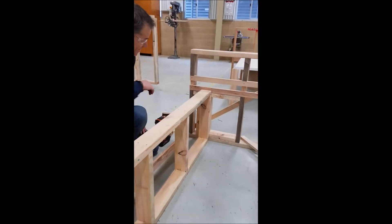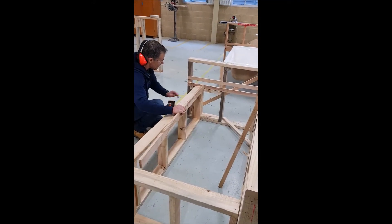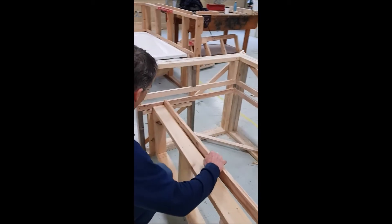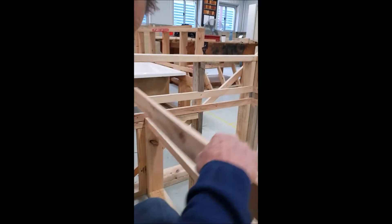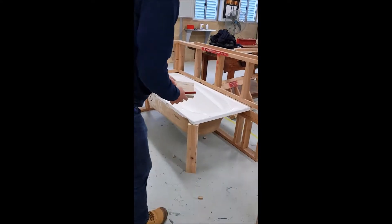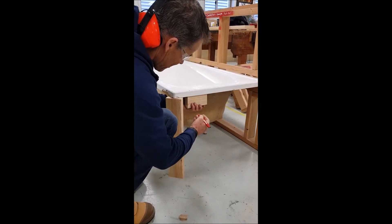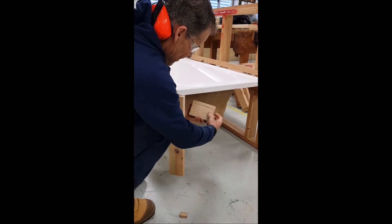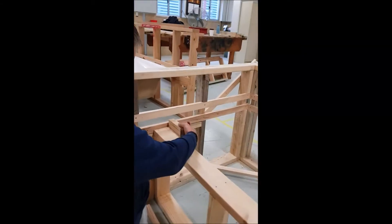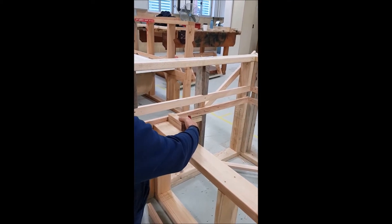We're going to support the edge of the bath with another piece of timber that's going to be screwed to the back. It's not going to be sitting at this level — it's actually going to be sitting a little bit higher. What we're going to do is go to here's the bath that we've installed previously, and we'll be able to mark that lip. Hold a block up underneath and mark that lip — that's the height. So this supporting member in behind is actually going to be sitting from that line up, and that's 16mm for bath number 4.